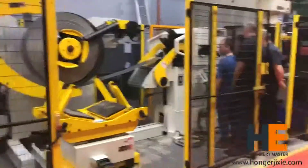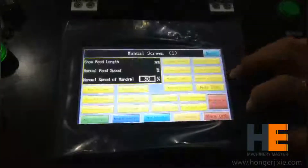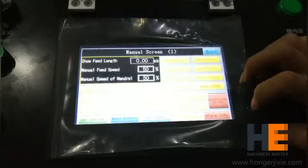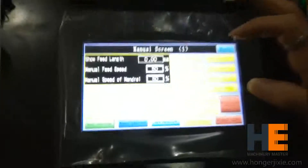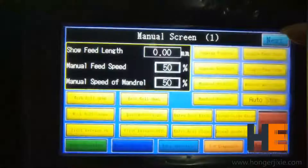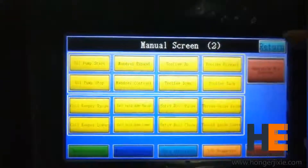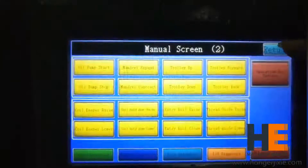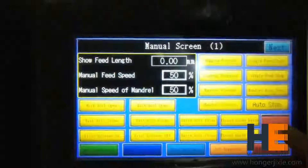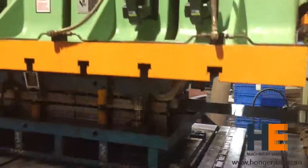Besides, on this feeder you can adjust all setups respective to feed length, material width, and die height, as well as feed and pilot release timing. This feeder can deliver the material with sufficient precision into the tool. It not only moves the desired amount of material into the tool, but also positions it precisely in the die — front and back, side to side, and square with the tool.